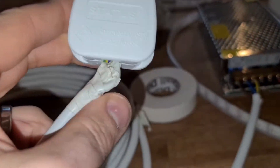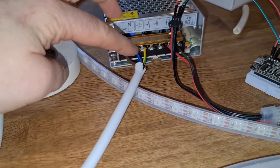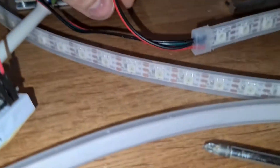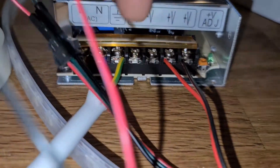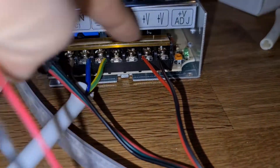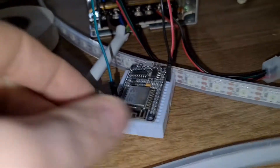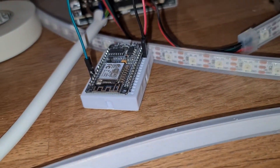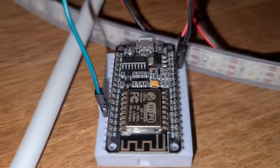We'll wire the plug up to this extension cable here, plugged into the power supply. So we've got live, neutral, earth into the power supply. Got the LED strip there - the positive and negative. I need to put that black one into the negative over there - it's two for positive, two for negative. So I'll switch that black one before we do anything. They go into the LED strip to give it power. The NodeMCU we configured previously will draw its power from there. And then we've got the signal cable which sends a signal to the LED, into D4 on the NodeMCU, which is what you need to do for the WLED firmware. So let's power it up and give it a go.